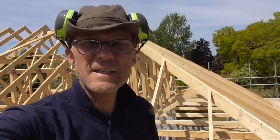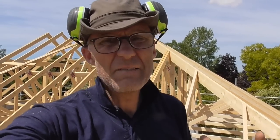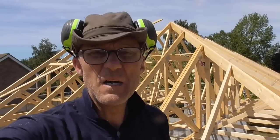And I do get asked quite a bit on some of my comments about striving for a certain standard or high standard, and I like to try and attain the best standard I can. And people say, do you need to recognise when you need to be chasing a top standard and when you don't? As much as I would love all of these cuts to be super flush and super tight on this truss roof, unfortunately I can only really work with what I've got, and this one isn't great. So I'm not going to turn myself inside out to try and get all of this to run in perfectly. The fact of the matter is, and I can't believe I'm saying it, once it's all roofed in, it'll look absolutely fine. And I'd like to think that a lower standard for me is still a good standard. So that's all in now.